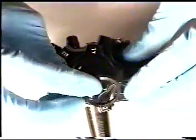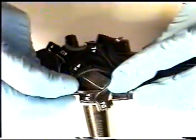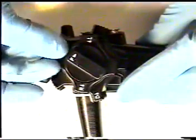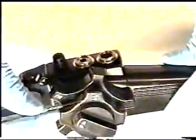Take your trim ring and with the notch side up, slide it over the longer post and carefully slide it up and over the knob. Use your number 1 screwdriver to be sure it has fit around the left-right lock knob.